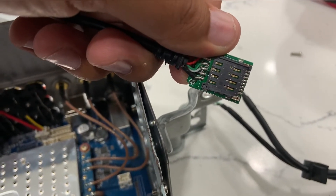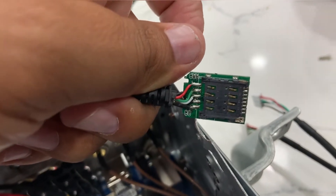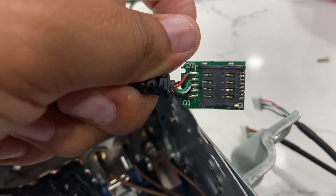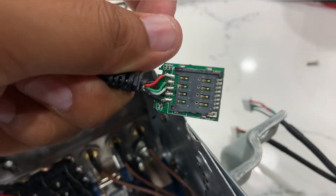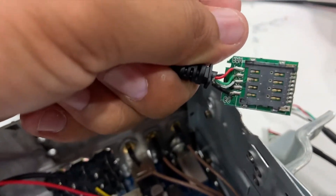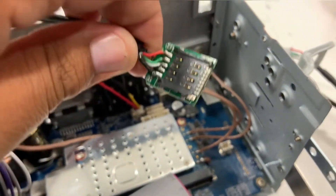So I decided to finally take it apart. I'm going to desolder this part and try to get a better look at the layout of the pins. I ordered a new SIM tray because I'm thinking that's the problem, but I'm not 100% sure. I kind of want to see the pinout layout — see how they have it wired, because it's pinned out to five even though there are eight pins; I know six of them are being used.